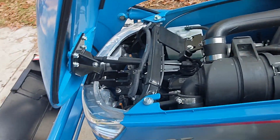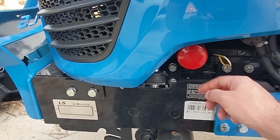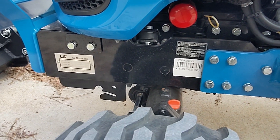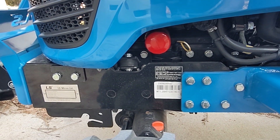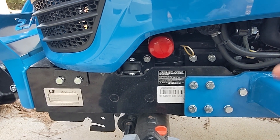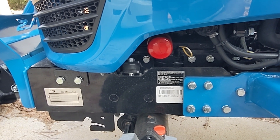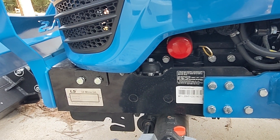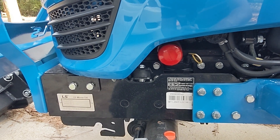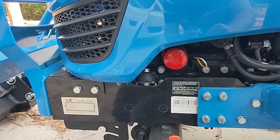The 50-hour service is pretty easy. It includes the fuel filter, air filter, oil filter, and the transmission and hydrostat filters underneath. Instead of going to the LS dealer, I got the Baldwin filter equivalents on eBay from an LS dealer — about $55 for the filters. Baldwin is a very good filter manufacturer. It came with one LS-branded filter for the hydrostat or transmission, since Baldwin didn't have a cross reference for that particular one. I'm running 15W-40 Rotella in this.